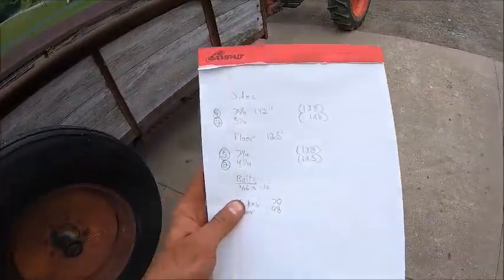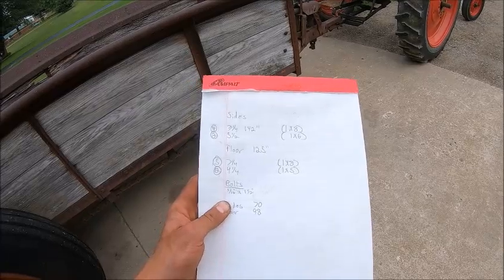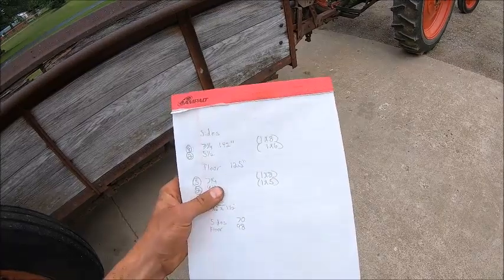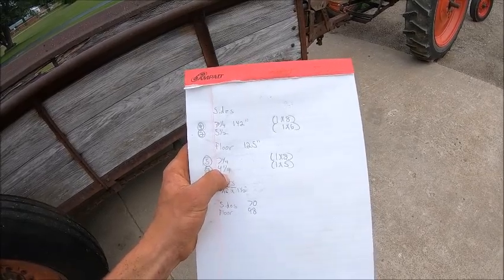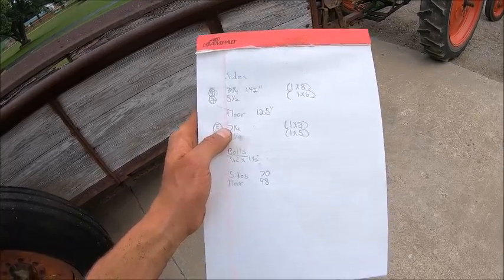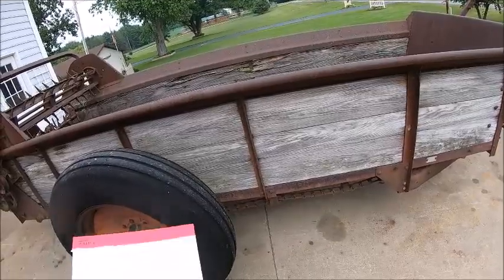All right, well, I got my list together. It's looking like I'm going to need 8 1x8s, 12 foot long, and probably 4 1x6s, 12 foot long, unless a 1x5 is a real thing, because I was looking up dimensional lumber and it says that 4.5 wide is a 1x5. But I don't know if that's an actual board or if that was just in their chart for lumber dimensions. And then a ton of 5/16 by 1.5 carriage bolts, 35 per side and 98 in the bottom.